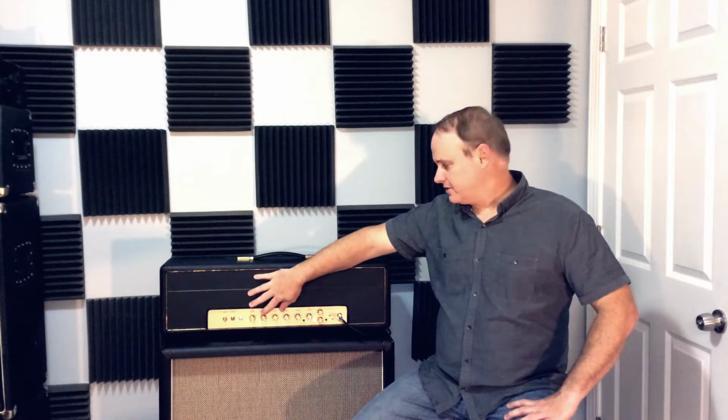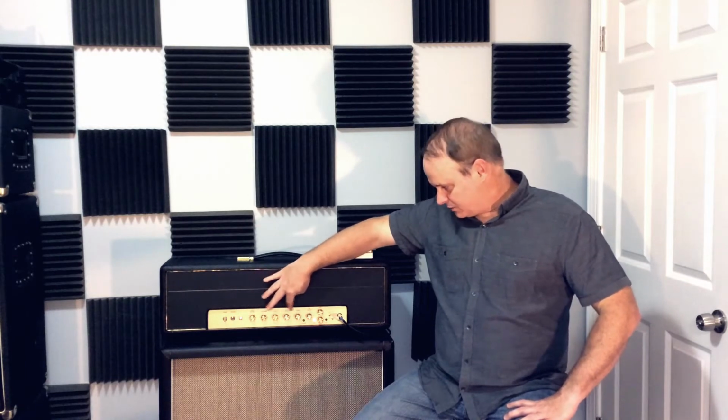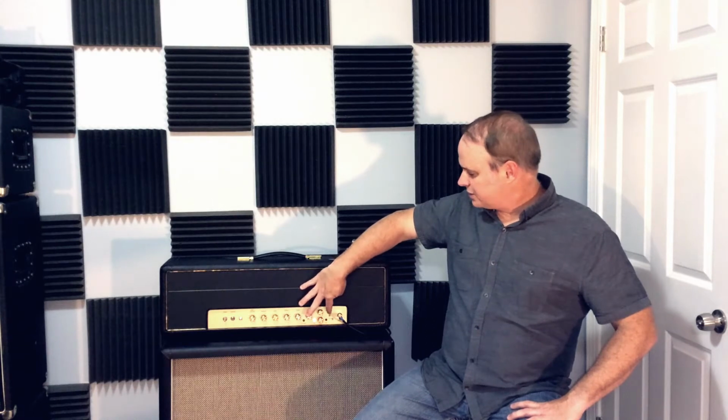After that, you've got your standard tone stack, presence, bass, middle, treble. It is a 2-channel amplifier, and that is foot switchable as well. You have channel 1, gain 1, and channel 2, gain 2. That's your channel switch there. And then there's also a bright switch that you can flip on to kick in an extra bright cap to brighten the amp up if you so desire.